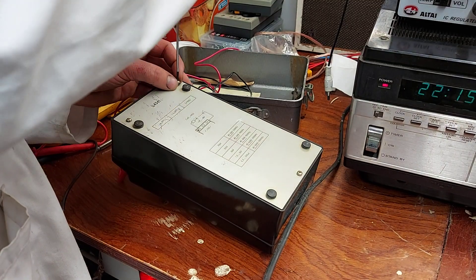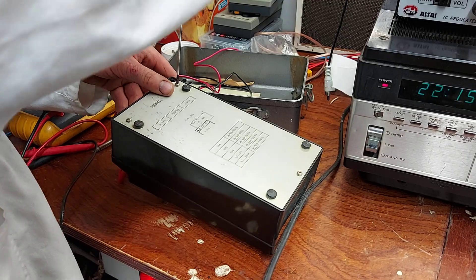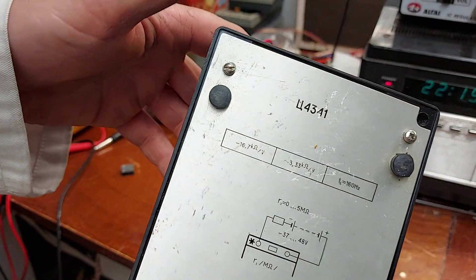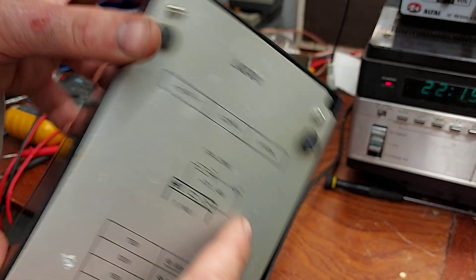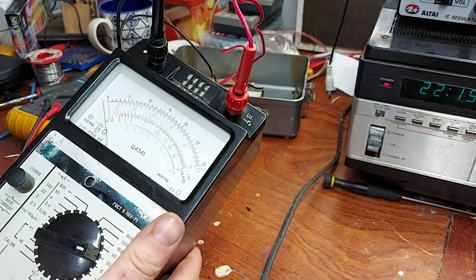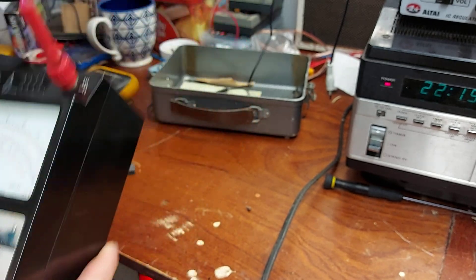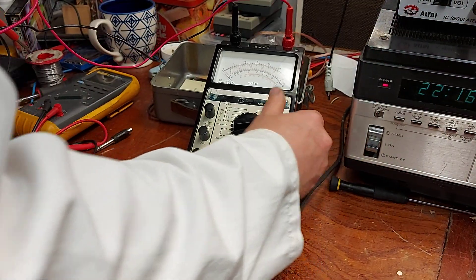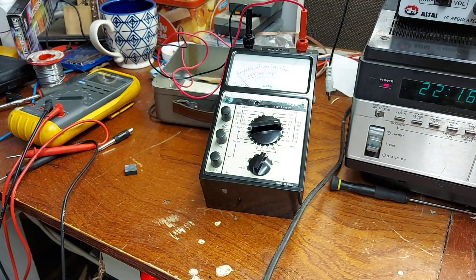She's not quite as sensitive as the AVO, but on DC she's 16.7 kilohms to the volt, whereas the AVO - which is of course the industry standard - is 20 kilohms. But it doesn't make much of a difference really unless you're working on very high impedance sources. So that's the story - what we'll do is zero that movement where it is at that angle.